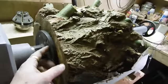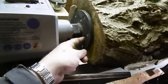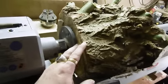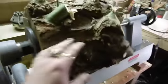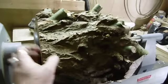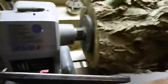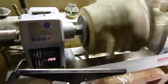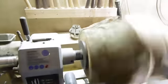It's screwing into end grain so you need some very long screws — three inch long — and I've got a screw in every one of them except for one hole, because I went to put a screw in that one and it just rocked, so I pulled it out. The whole idea is what I like to do is to turn a tenon first, and then actually mount it in a chuck before I do the majority. The maximum I can get this up to as it stands is about 216 RPM. As you can see, it's wobbling, as expected.